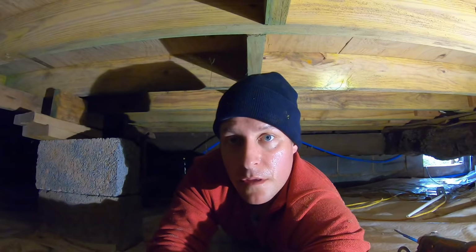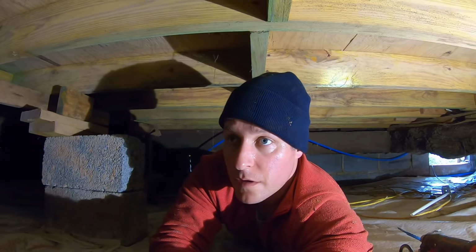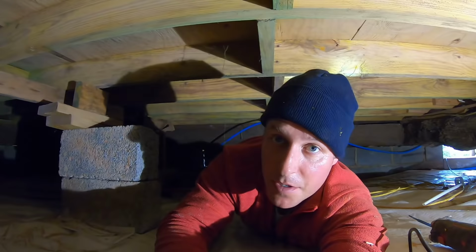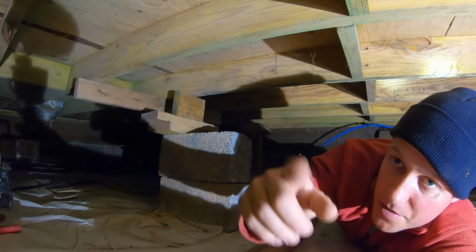All right, so we got the old 2x4 that was the old support beam out of the way. It's cut and dismantled and taken off, and we have a couple temporary supports up now on, you know, about 12 inches to the right of the footings where the new beam's gonna go. You can see one here. I mean, nothing crazy. There's one back there with a jack. Use the bottle jack. There's one up front. I'm just doing half of the house at a time.